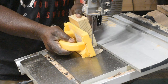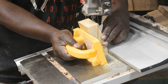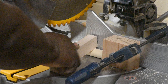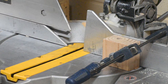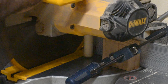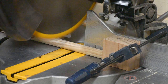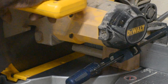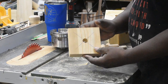Now I need to cut my dowels — I cut those just under four inches. I'm using a block here with that short piece because I don't want to hold it with my hand. Another thing: doing an operation like this, it's best to wait until the blade comes to a complete stop before you pick up the piece, so that the teeth don't pick up your workpiece as it goes back up — as you can see happened to me.